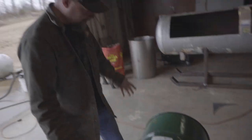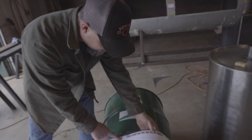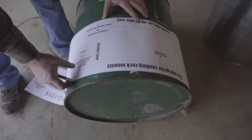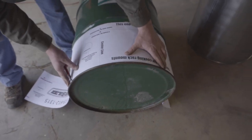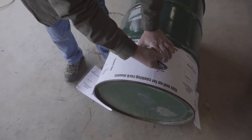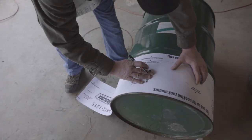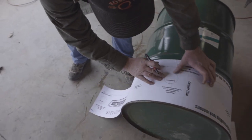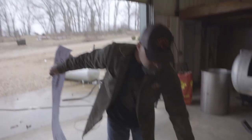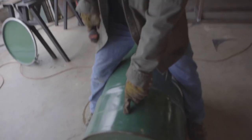We've got this ugly barrel and our template. We have a deep-dive video that shows you how to use this template to lay out your barrel on our website. This ends up for air inlet holes — here's the center line. We're going to put that somewhere from the center line over. We've got this little hole right here — it's the center of the air inlet, 10 inches from center line and approximately three inches up. Mark that hole, then just rotate and hold everything together. That's all we need — we're going to drill those two holes.